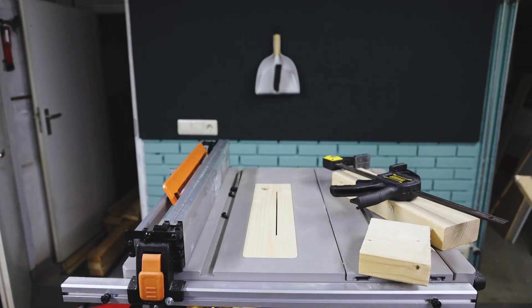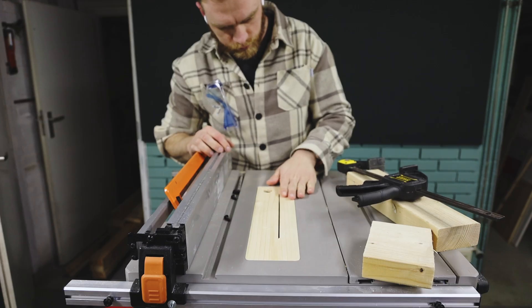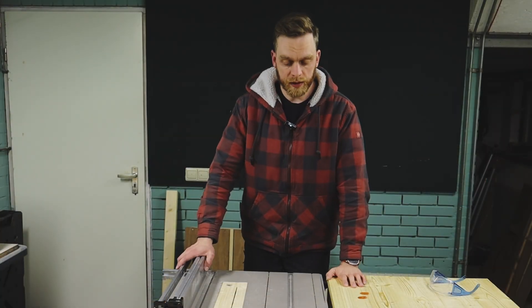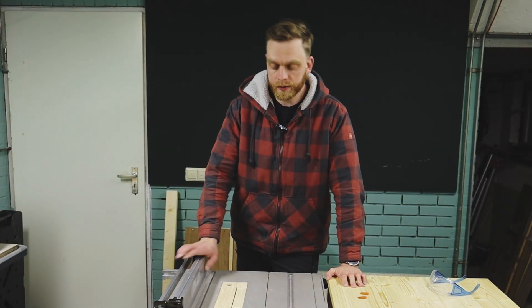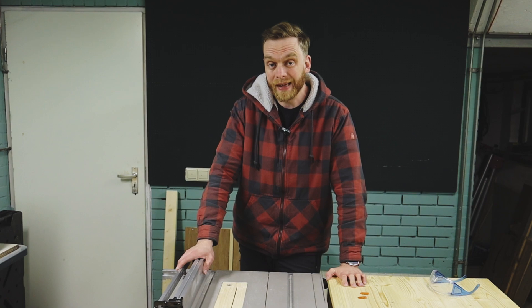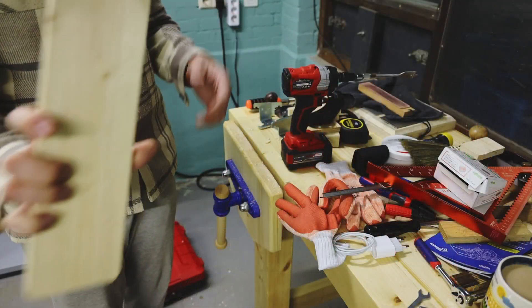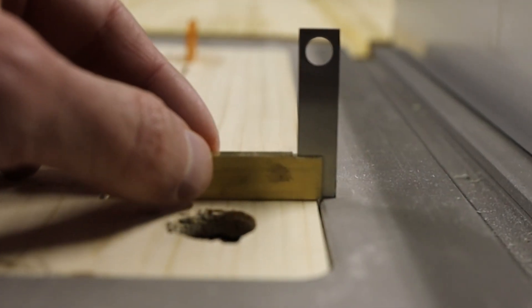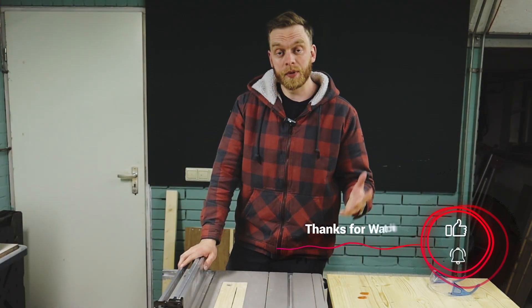Cleaning up the mess — and look at that, isn't that beautiful? Well, it's been a bumpy ride. If I had to remake it, I'd remake it after I have a proper setup again, so I would take off less per pass on the planer to make sure it's properly flush. There's about half a millimetre of unevenness, but for now — good enough. Hope you enjoyed it.